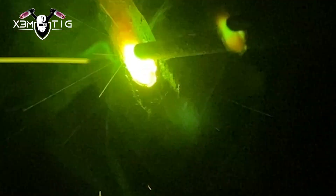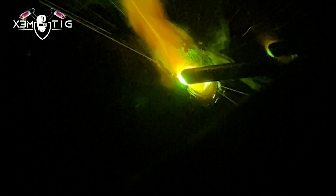However, some welders may choose to dip their 6010 prior to welding. If you do, it should only be dipped for a few seconds, as prolonged exposure can cause the coating to break down — as I showed with that yellow water earlier. It's worth noting that dipping 6010 in water is not a common practice, and most welders prefer to follow the manufacturer's instructions for storage and handling.